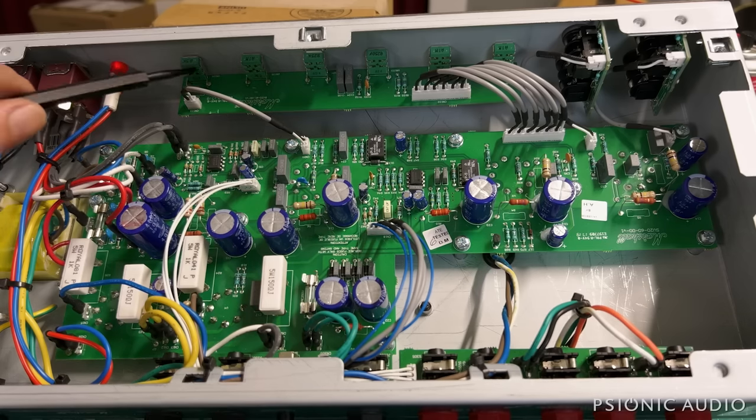The amp is overall fairly quiet. There's some router noise coming through. Hiss on the bright channel, not too bad. Let's see. No noise on the tone pots. The expected noise on the presence, because they're doing the legit 5K, which has DC across it. So if you get one of these and you have noise on your presence control, that's normal, nothing to worry about.